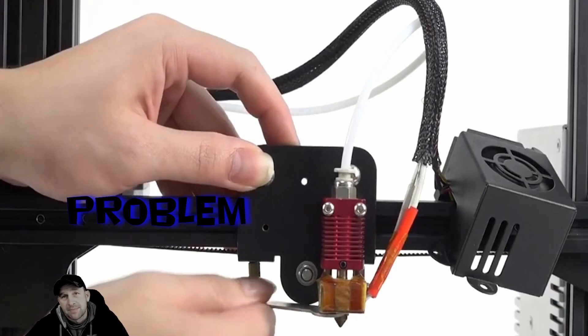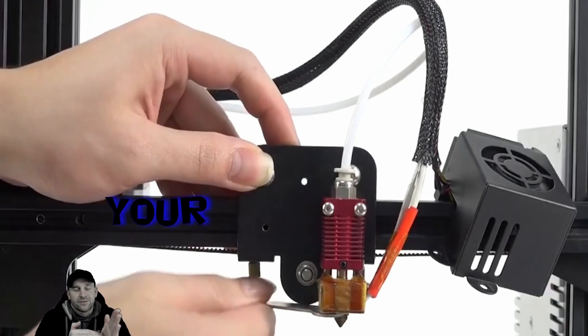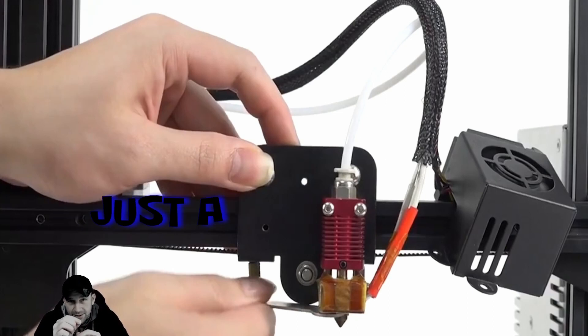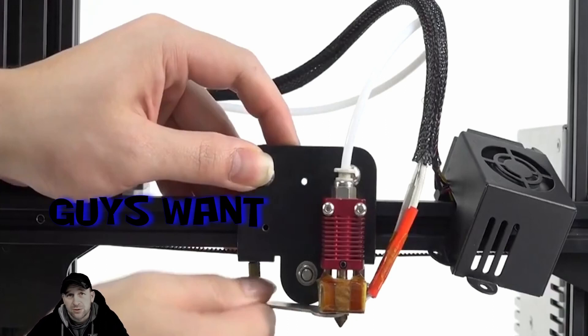This can be a problem if you don't clean it. Make sure that after every use you do clean this — make sure your filament is either pulled out or has been fully cleaned out. What happens is it burrs up in there, and then your new filament going through will hit a piece that's either hot or cooled and buried up inside, causing the extruder to send through only a very minimal amount of filament, skipping it, and then building up more.